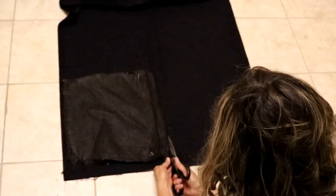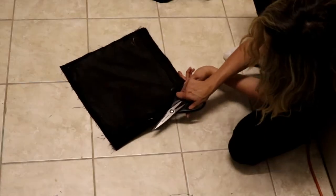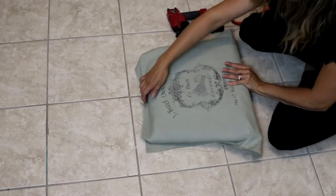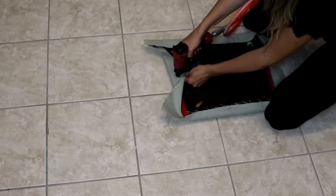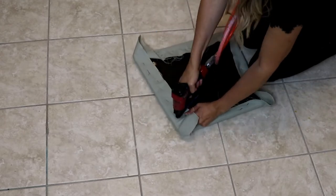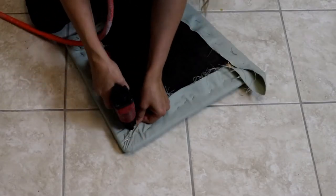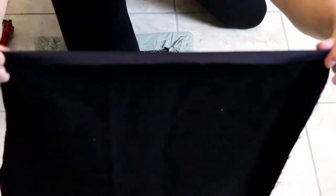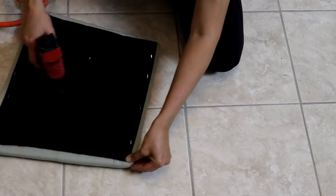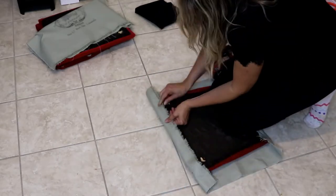Cutting four pieces of dust cover fabric using an old one as a template. Placing the fabric on the cushion of the seat, making sure that the image is centered. Stapling the fabric in the center of each of the four sides of the seat, then pulling and stapling the fabric working out towards the corners. Folding the fabric at the corners and stapling in the center of the fold. Grabbing the piece of cover fabric, folding edges on each side so that we have a neat finish, and securing it with the staple gun. Repeating all these steps with the rest of the cushion seats.